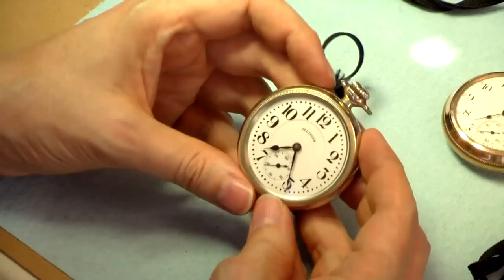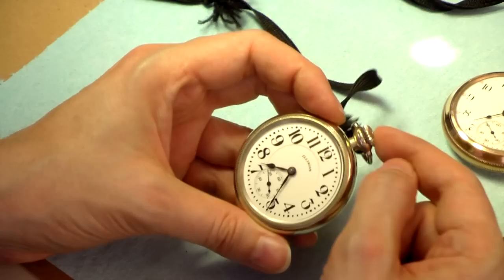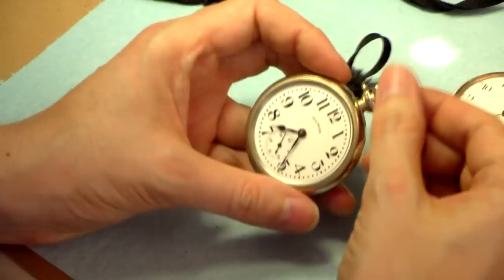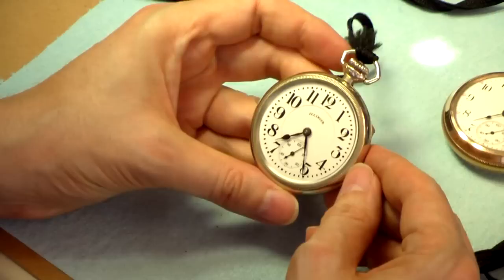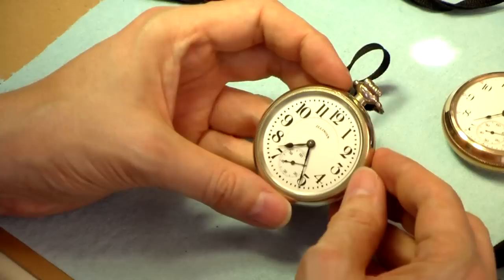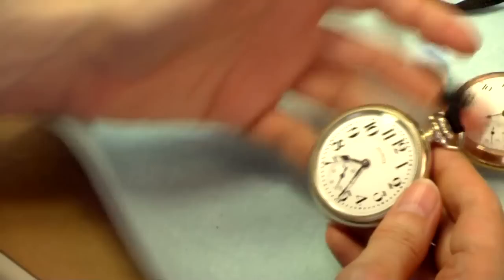Here's my 1928 Illinois, and to set it is pretty easy. All of my watches are stem set. To set the watch with stem set — this is the stem here with a little winder. All you have to do is pull out on the stem and it goes to a second position, which allows you to set the time. Pretty straightforward: set the time, push the stem back in. Watches of this era had several different ways of setting. All of my watches are stem set, but some of them, especially some of the railroad watches, will sometimes have lever set. I'll show you where that's located.